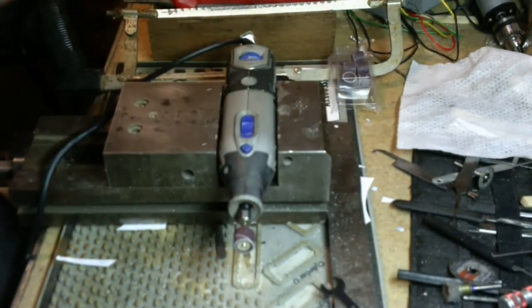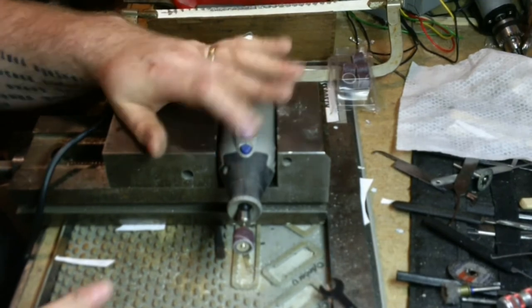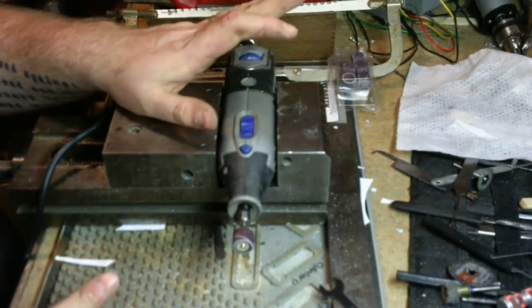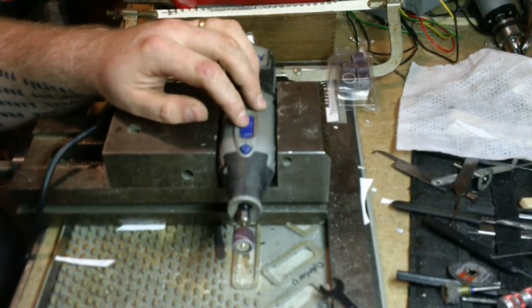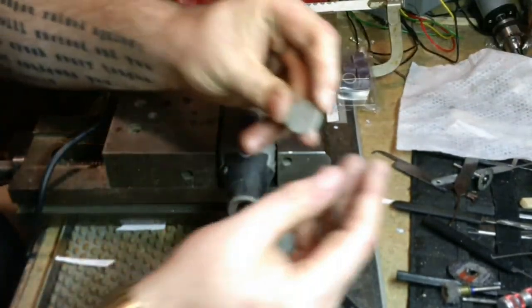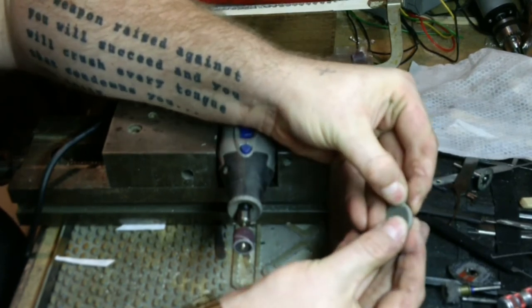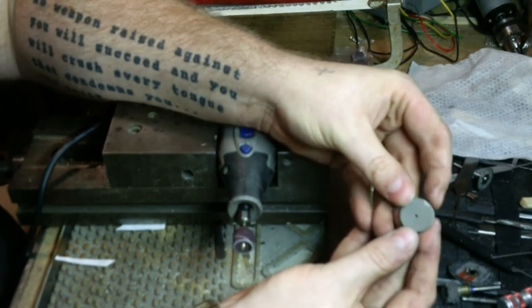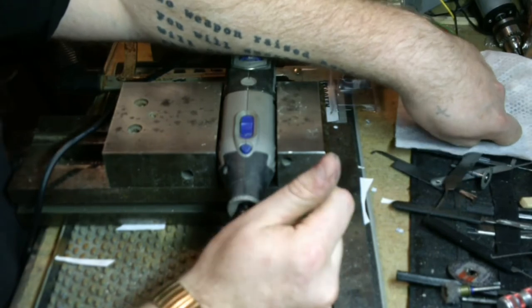Harbor Freight, love them or hate them, they sell an abrasives kit, and it's like 149 pieces, comes with a bunch of stuff in it. If you're short on cash, it will do in a pinch. You get a lot of those fiber cutting discs that will actually kind of hold up. You get a lot of grinding wheels. I will warn you, the hard grinding wheels aren't that hard, so you might not use these wheels, but others are okay, and it may change based on your kit.